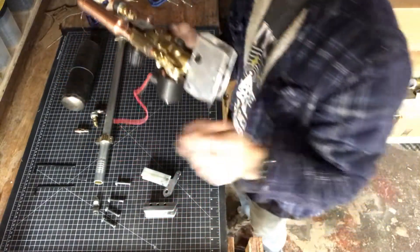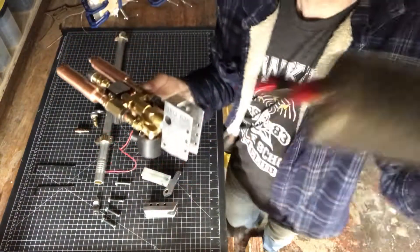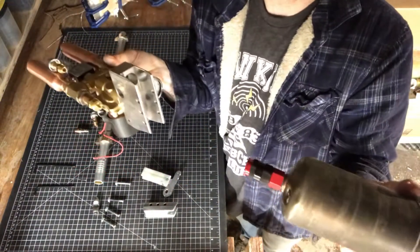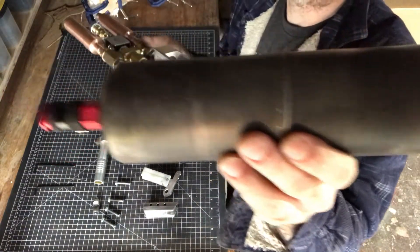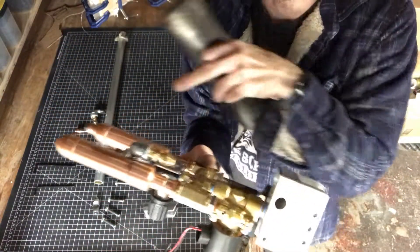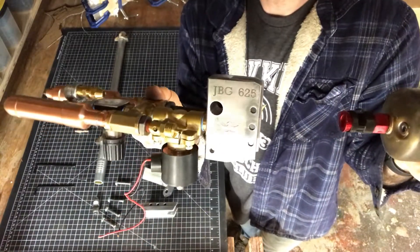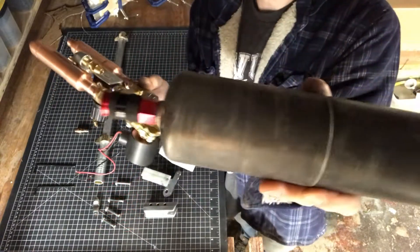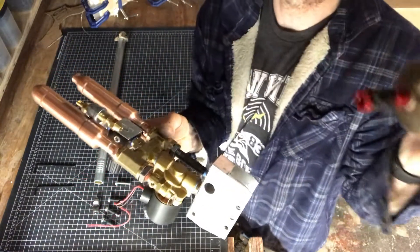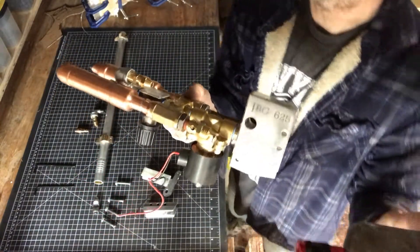There are going to be a couple of these tanks behind in the stack. These are going to be high pressure tanks, and this is going to be the low pressure tank. So every time you squeeze the trigger, these get emptied and slowly get refilled from this one — there's a restrictor in here that I put in with a filter.